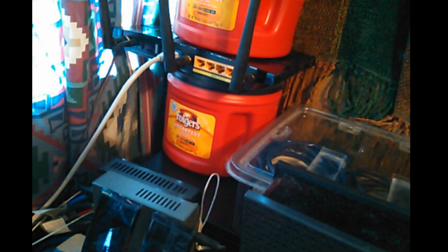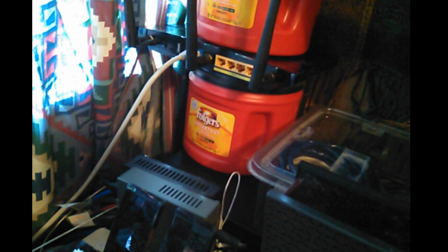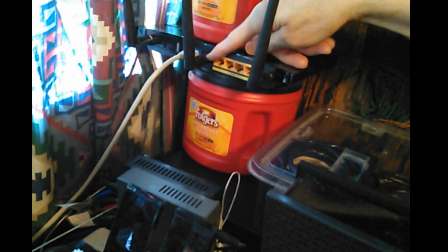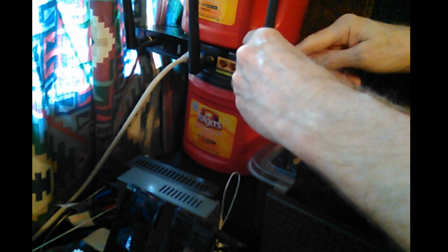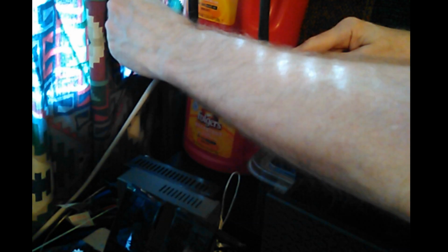Let me show you what I'm talking about. Now see this nut right here? Look at that. That's because there's a backup nut to tighten it in, inside the case. If you don't watch out, that comes loose. I mean, it's really loose. That one's okay, but two of them were loose. They screw off. They've been turning them up and down to get them out of the way when I'm back there, I'm sure that caused it. But the backup nuts should have been tighter than that. They shouldn't have come loose so easily, that's for sure.